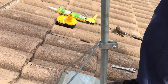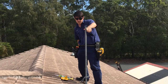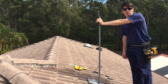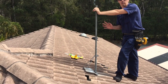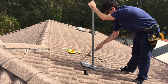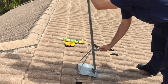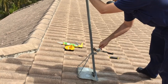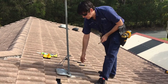So I usually just tend to push the pole back. There are two ways you can do this — you can get an actual proper level and make sure the pole is perfectly vertical. However, I've tended to always just eyeball it. My reason for eyeballing it is that when someone looks at this pole, they're not going to be putting a level against it — they're going to be looking at every other pole nearby, and if mine was different to those poles they'll think my pole was out. But try and get it as straight as possible because you want a nice vertical pole. Then tighten off the tripod bracket first — that fits the angle — and then we can tighten off the one down the bottom.